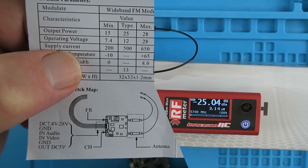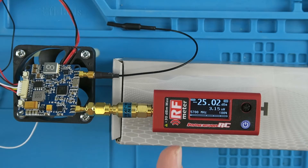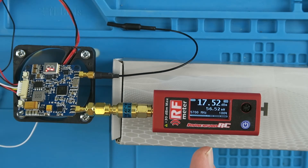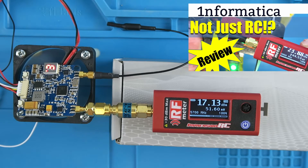There's only one way to find out. I have my power meter hooked up with a 3 dB attenuator — the reason being that the higher output of 800 milliwatts would overheat the internals of the meter. The board is set for 50 milliwatts with some cooling applied. Switching on, we're seeing around 50 to 55 milliwatts, which is within acceptable limits. It's on channel 1 with frequency band E, making it 5705 megahertz. Set up at 57, that's close enough. The meter shows 50 milliwatts, drawing just over half an amp at 12 volts.